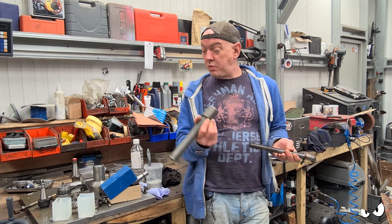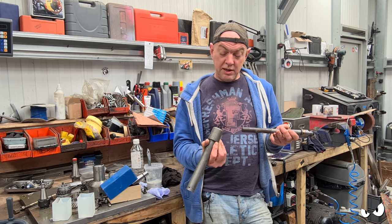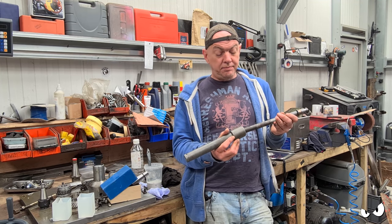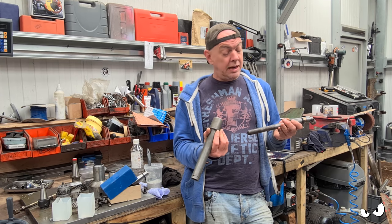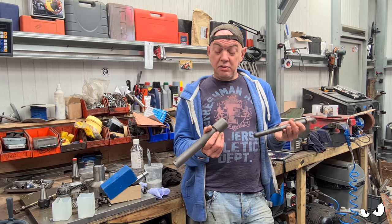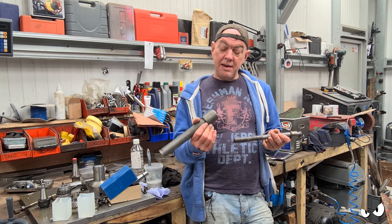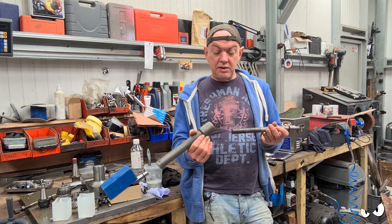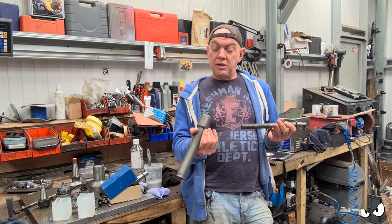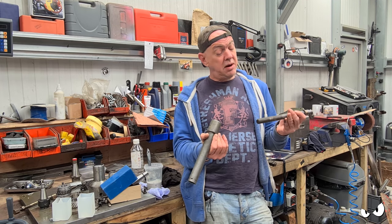I took it into work when I dropped the spindle and the tooling off to Brett for him to machine them. And he's had a go with a very large hammer and a drift and boshed it out basically. But the petrol and diesel stuff was starting to work because where the prop shaft came out the casing, it was wet all the way along, so it had started to get through. I thought he was going to heat it up with his rosebud torch and then have a go in the press, but no, he just bashed it.